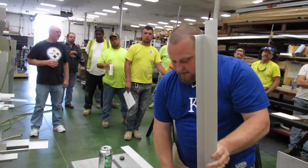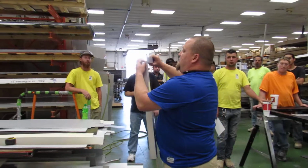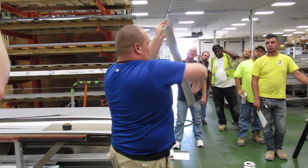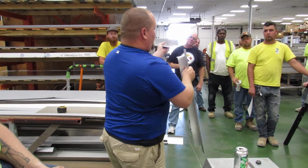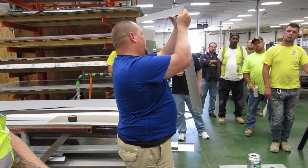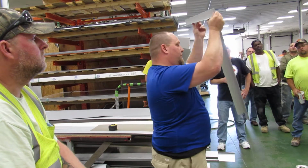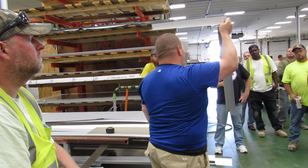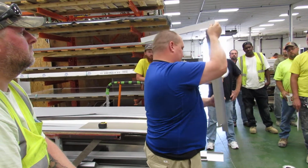By having the head go in last, you get a shingle effect from water running this way, and it's running down. You do not want to end up with a shingle effect like that, because you have a line in the front. Once again, you've now caused another weak spot in this corner. So it has to shingle on the outside. You always want to shim outside of it. You don't want a vertical line unless it's at the bottom.